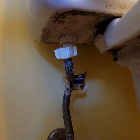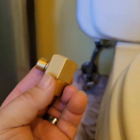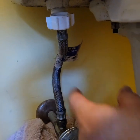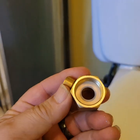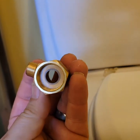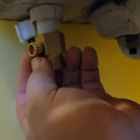The water's coming out there. Now this adapter they gave me is going to make things a little bit different — it changes the whole length of my supply line. When I put it in it may cause me to have to bend this supply line too much. We'll find out if it works or not; if not I'll have to buy a shorter supply line. Keep that in mind. This comes with a rubber seal — you want to make sure that rubber seal is in there, and you don't want to cross-thread this.